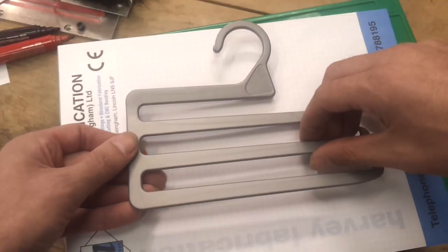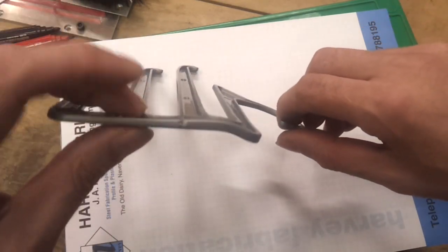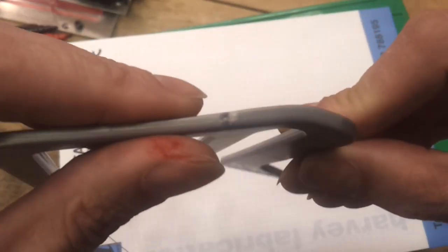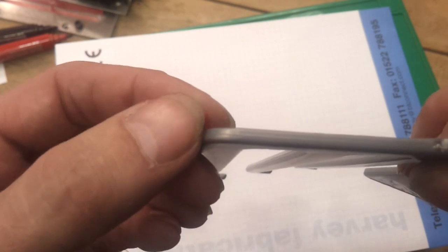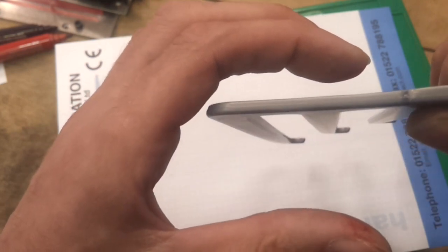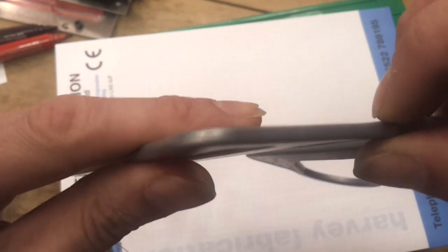This hanger is a little bit harder to mould — for a start they've got a bit of an angle going on, so the mould is actually more sophisticated. From a tool making perspective, you can see that the parting line on here is pretty much dead centre, and that's because they've got a rounded edge. If you've got an edge that is rounded like this, putting the parting line here is going to create an undercut.